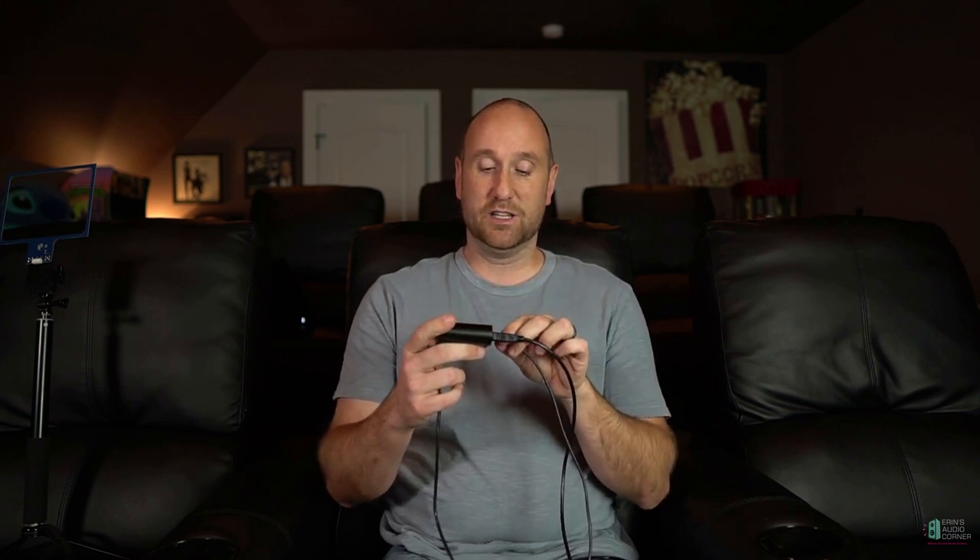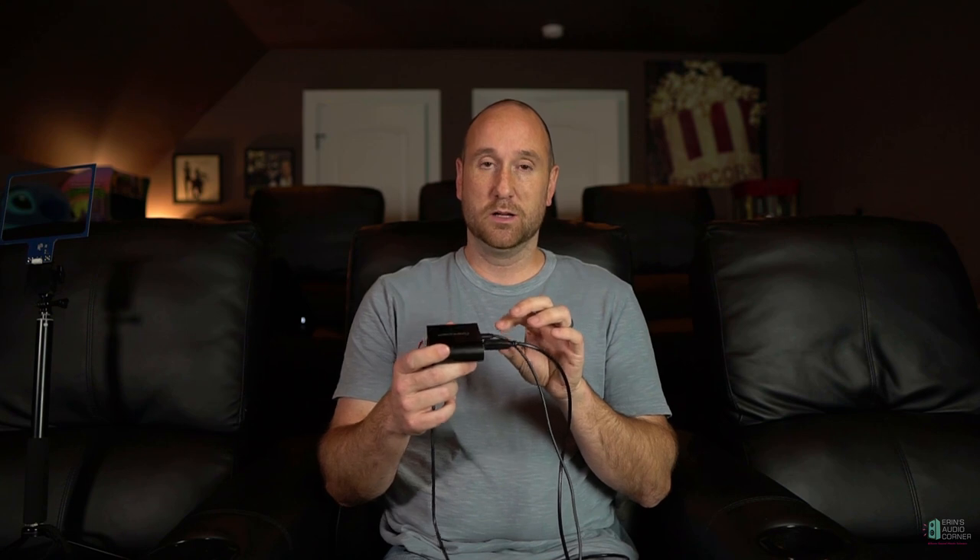One thing to note about the power connection: I initially made the mistake of connecting both USBs to my computer, thinking the USB power connection would draw enough power from my laptop. That was not the case — I was noticing very intermittent capturing and it just didn't look right. When I moved the power brick to the wall via the power brick adapter they give you, everything worked fine. I reached out to MiniDSP to verify and they confirmed you do need to power it via a wall outlet. So don't connect it to the laptop — connect it to a wall adapter.